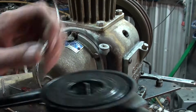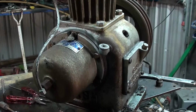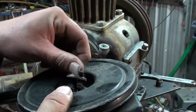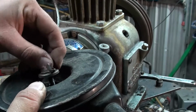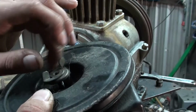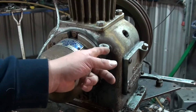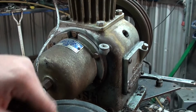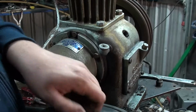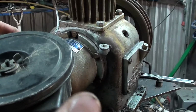So what I'm proposing we do is put the wing nut there. We get this nice little filter assembly. I'm going to mount that on the side of the compressor tank. I'm going to see if I can take that elbow off, or I might have to cut it and then wind it out of the side of the compressor. Get that out. Screw in a 3/8 hose barb fitting. Run that up to the side one here, and use that crankcase vent to go in the side here.